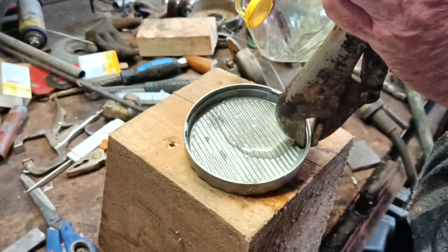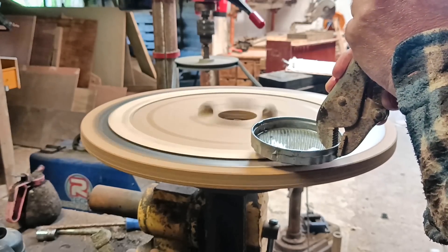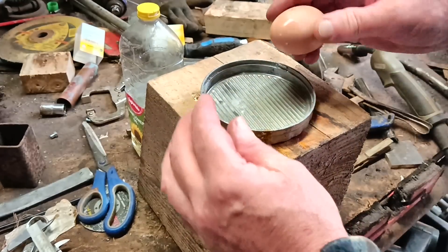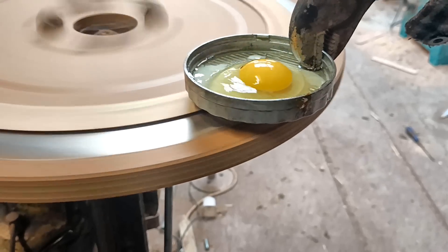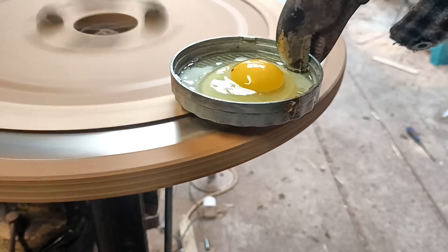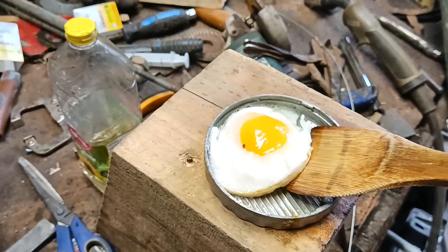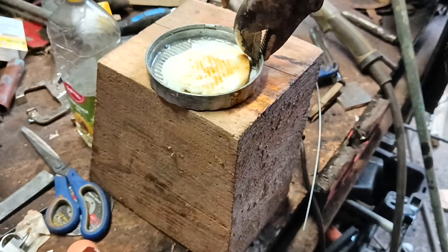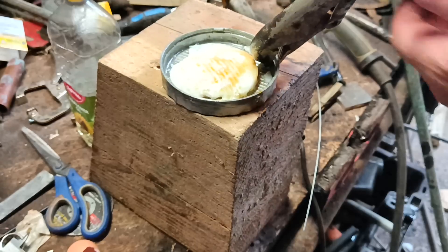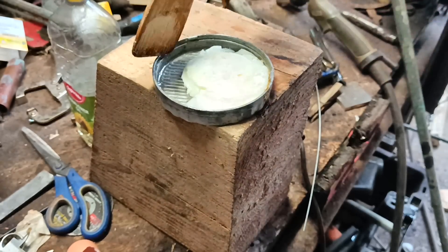And after that, I fried an egg. Because why not? I'm just still messing around and exploring the possibilities of induction heating. Because another thing I learned was that this is still spinning way too slowly to work properly. This is flipping the magnetic field at 40,000 times a minute, which is around 650 times a second, which sounds fast. But real induction heaters flip their magnetic fields at a rate of 100,000 times a second, apparently, or even faster. So the next experiments will be on how to get this going faster whilst not actually firing magnets into the next county.